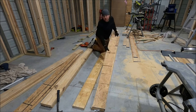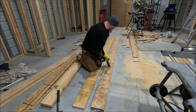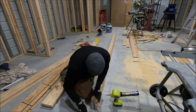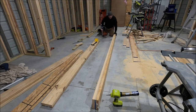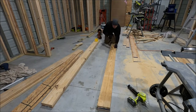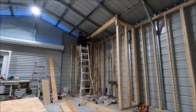The entire ceiling including the drywall, the ceiling joists, and the insulation is approximately 2,600 pounds, so the beams I made were definitely overkill for what I was trying to support as far as the ceiling is concerned. I used regular batt insulation up in the ceilings because it was a lot lighter, and then I used Rockwool in the walls.